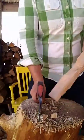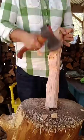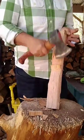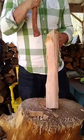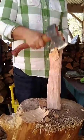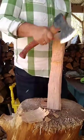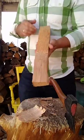So I skip making a square billet at first. Is that a thing of experience? Yeah, I do that just because I guess you need to have the experience to look at a piece of wood and say, okay, if I cut this crank into the face, there will be enough material there. But the other nice thing about it is sometimes I can get away with stuff within a billet because I haven't taken the time to make it square, and maybe a little bit of wood protruding at the bottom is just enough to give me enough belly to the bowl. If I squared it up beforehand, then I wouldn't have the material there. So it does allow me to make the most of a particular piece of wood. And I guess that understanding comes from experience.